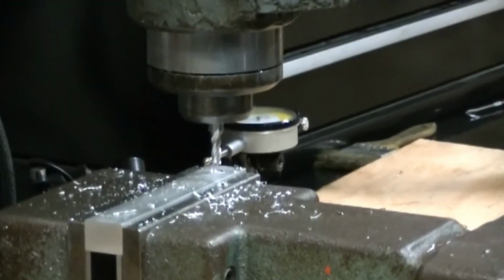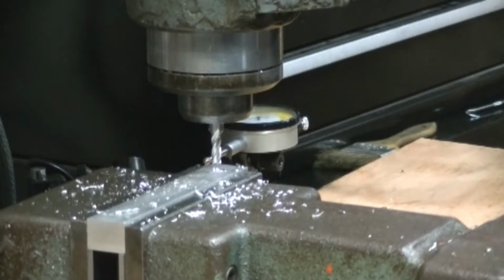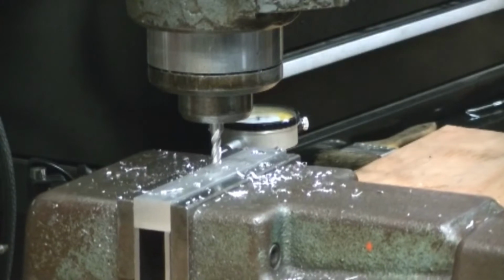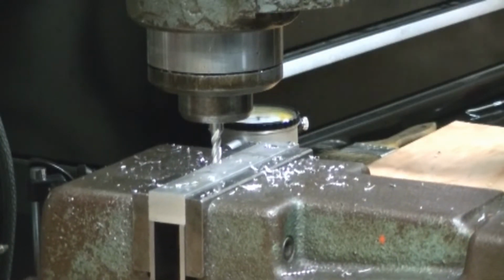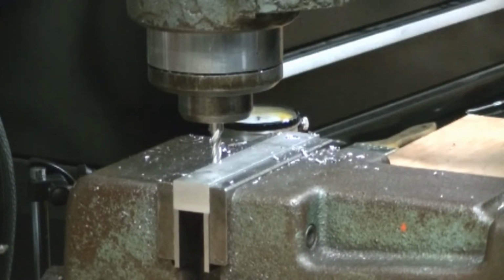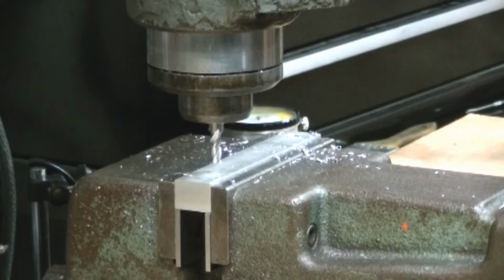Alright, the cutter gummed up just a little bit. So what I'll do now is unlock my table. I'll come over to my other axis, looking for my indication mark of when I should look at my indicator for 0. Call that about perfect there. Lock the table.